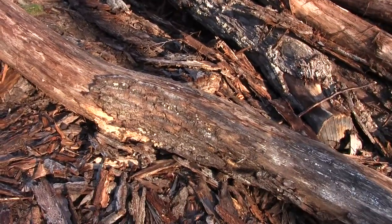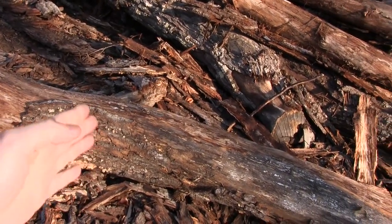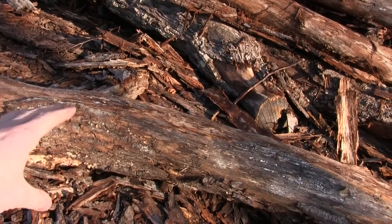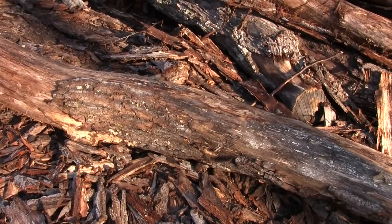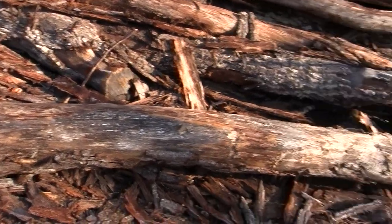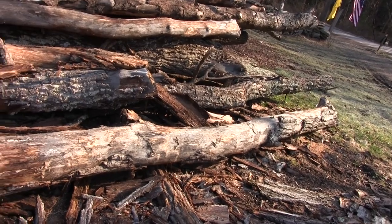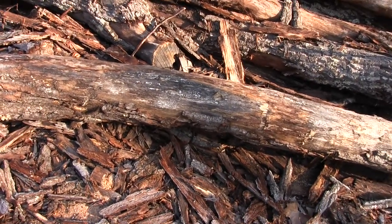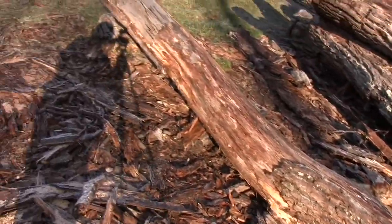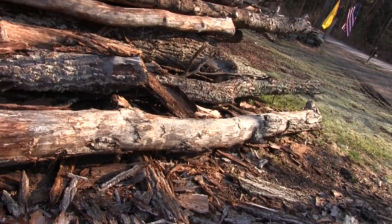Being that it's crooked, I might try to cut it in a place where the bend in the log won't have as much effect when it goes through the machine. That's important because you don't really want to fight with these things once they're up on the live deck or going into the infeed conveyor. If they're crooked on the infeed conveyor, they can become a real hassle. So anyway, that's what I'm doing, just getting these cut up and cut to length.